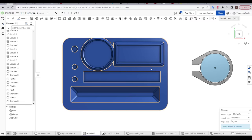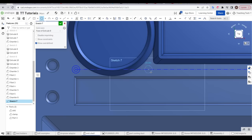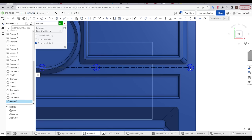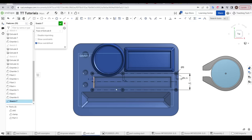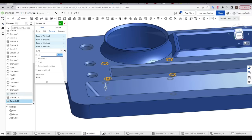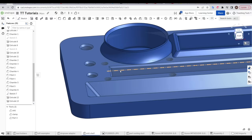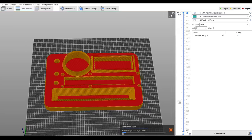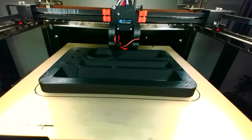Before we're ready to print, we need to add some holes through this part so we can screw into the third part, which will be the bracket. I start a sketch on the surface and draw a position for a row of circles — the inner circle being big enough for the screw to pass through, and the outer circle being big enough to clear the head of the bolt. I set up a construction line through the middle and mirror this row of circles down to a second row. Everything's black and constrained, so I'm ready to extrude — one hole the whole way through for the bolts, and the outer hole 6mm down to create clearance for the head of the bolt. This part is the least crucial for strength out of the three, so I don't turn up the infill to save filament and time. Even so, this was a 7.5-hour print that I had to run overnight.